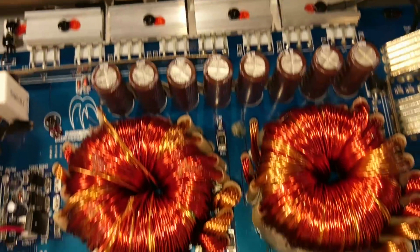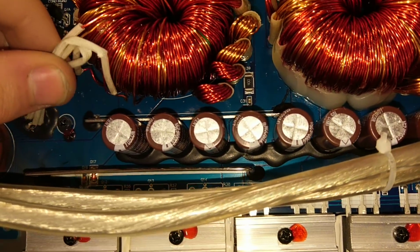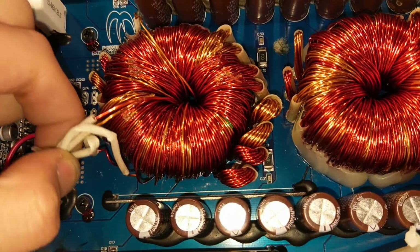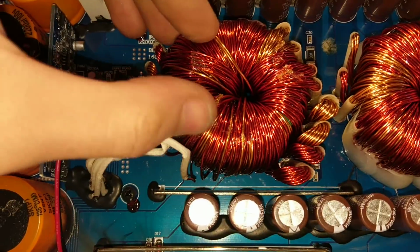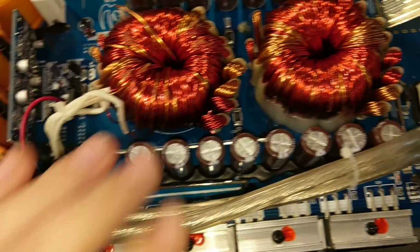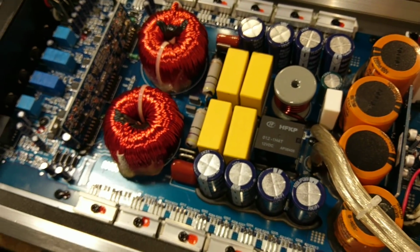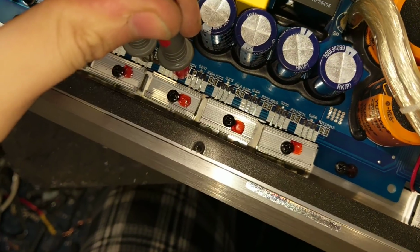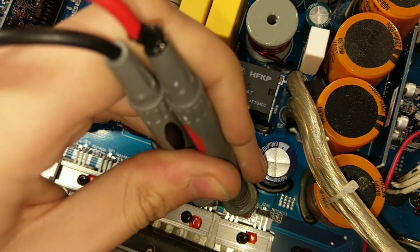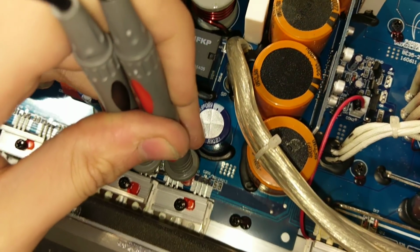But yeah, in terms of this amplifier, it's got a blown power supply section, obviously. This isn't good. This is bad build quality. That should be glued down. That could be shorting on leads, which could be why this power supply failed in the first place. Or it could be the output section of this amplifier that's shorted and killed the power supply along with it. So let's just quickly see whether we have any shorted output MOSFETs, and try and do this with one hand. No, this side seems okay. There we go. So no, the output section failed and killed the power supply.